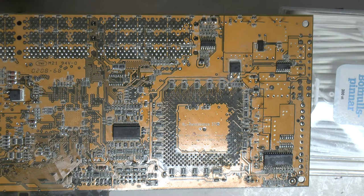Also, before we could use the 4.8 millimeter tip, but now when we need to get stuff back with all the small SMD stuff around and so on, we need to use a smaller one, so it's not going to be as able to put heat into the board.